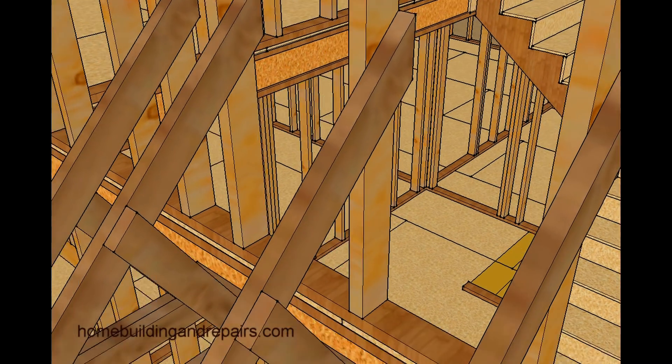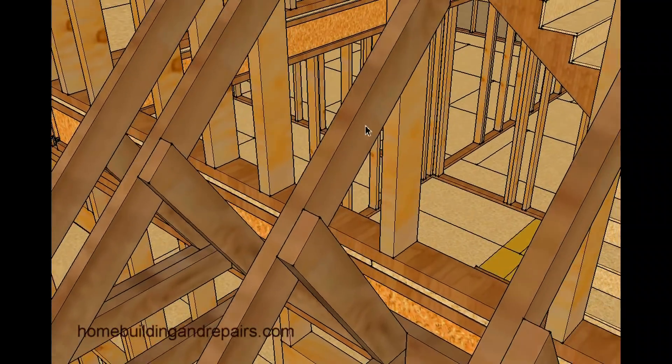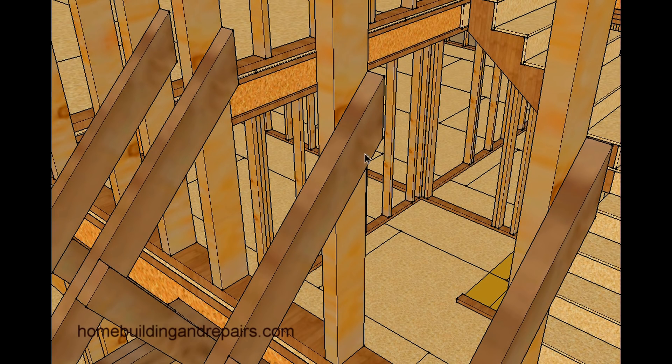Rafters are tied to the wall studs. The ceiling joist shapes allow for maximum nailing — you're going to want to put a few nails in here. If you feel like bolting them, you can run a carriage bolt or a regular bolt with nut and washer. I would say a minimum of 4 nails for the 2x4s we're using, as long as the wood isn't splitting.